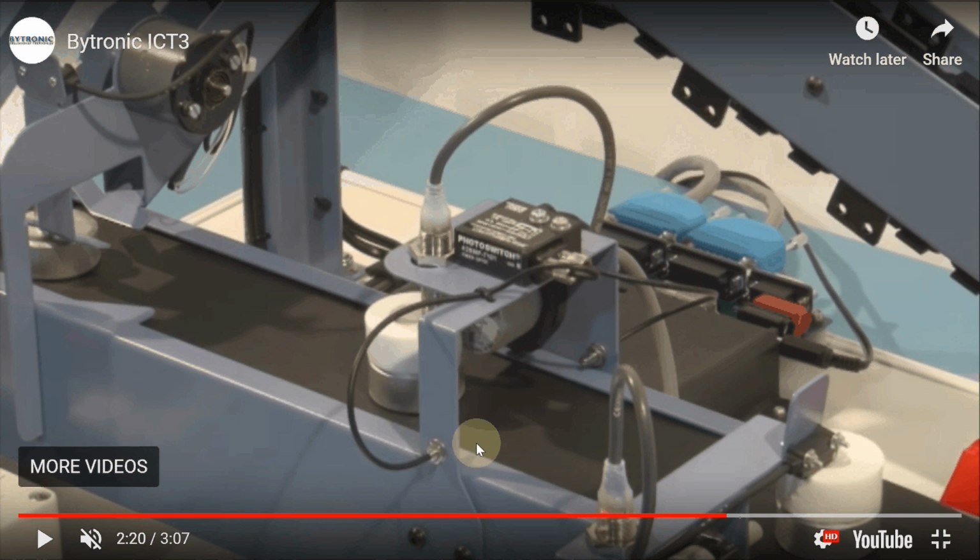So here we have another type of sensor, a capacitance sensor, which simply judges the cross sectional area and height of this plastic chain. At this height, it will check the distance between these two plates. These are acting like two plates, and by passing this assembly between them, it will calculate the generated flux, and it will allow or reject it by sending the command to this solenoid valve, which is also detecting the position of the components by this infrared sensor.